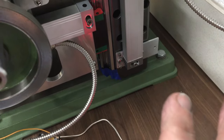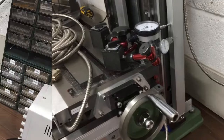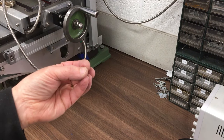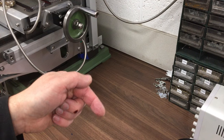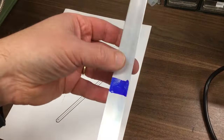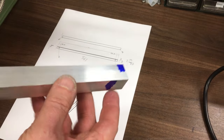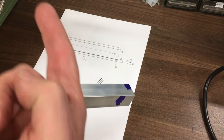Right, we'll just make sure these are tight at the top and bottom, and push the grub screws in to make it nice and secure. Then we need to make up the bracket that goes up the back. The DRO is mounted now - the next thing is to make a really long bracket that goes up the back, housing two micro switches: one for the top limit and one for the bottom. They'll feed back to the Arduino to stop movement if the knee gets too close and trips one of the switches. I've got this piece of angle aluminium, marked up to length, and I've offered it up to the machine - it's a nice fit.